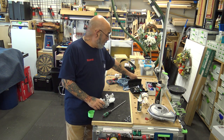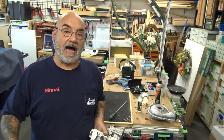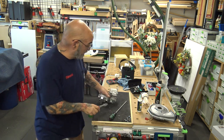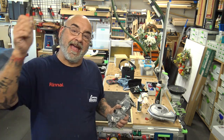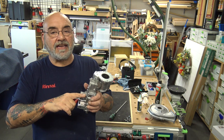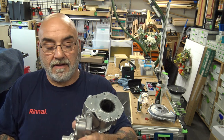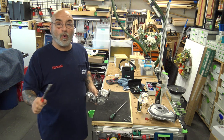All right, so now let's look at the conversion. Now, I'm going to show you why this pair of pliers is so indispensable. Brand new units out of the box, we stock the RUR and the CU in natural gas only. But then we have to convert it, and as you can see in my kit here, I have a ton of conversion kits. Brand new from Japan to Peachtree City to the distributor, these screws sometimes will not even come out with that screwdriver. So the pliers grabbing that, and the pressure, will take them right off. Right off. No questions asked.